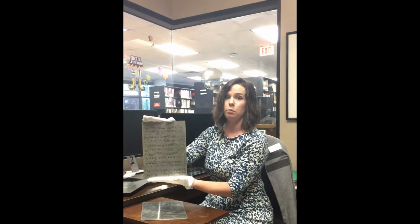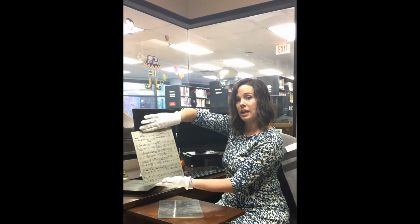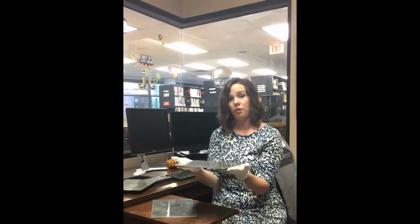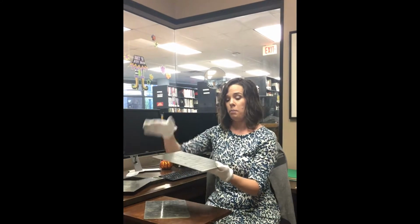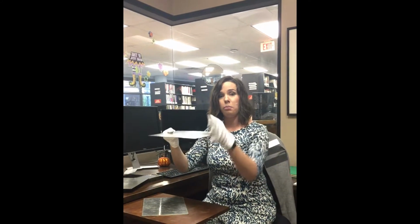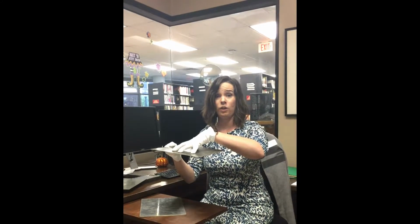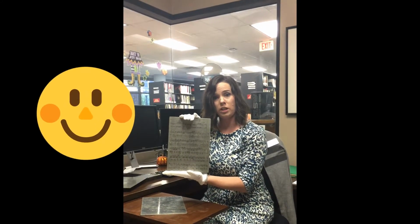They would start to see if it would print correctly by doing a proofing. To do a proof, they would smear ink over the plate. They would then take a squeegee and squeegee off any excess ink, place it flat on the rolling printing press, put a piece of paper over the top, and then put it underneath so that pressure forced the paper into the grooves the engraving creates, thus transferring all your musical notation to a sheet music.